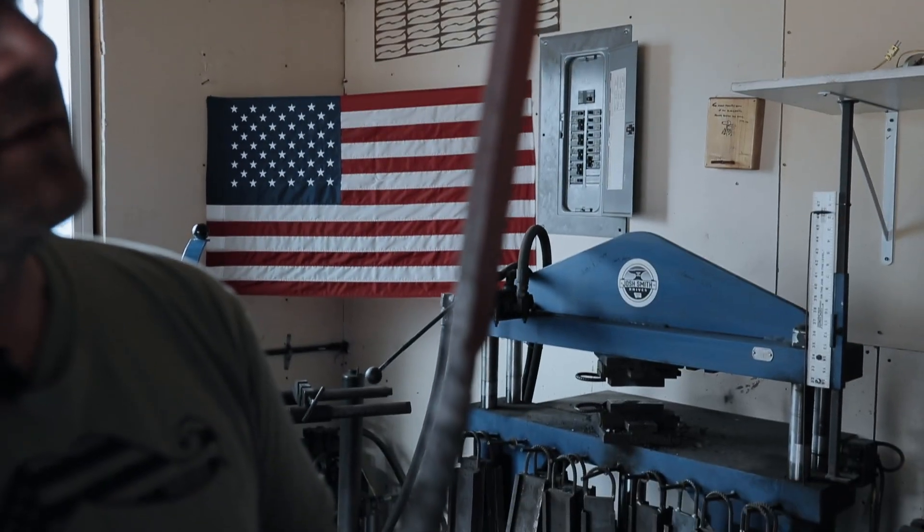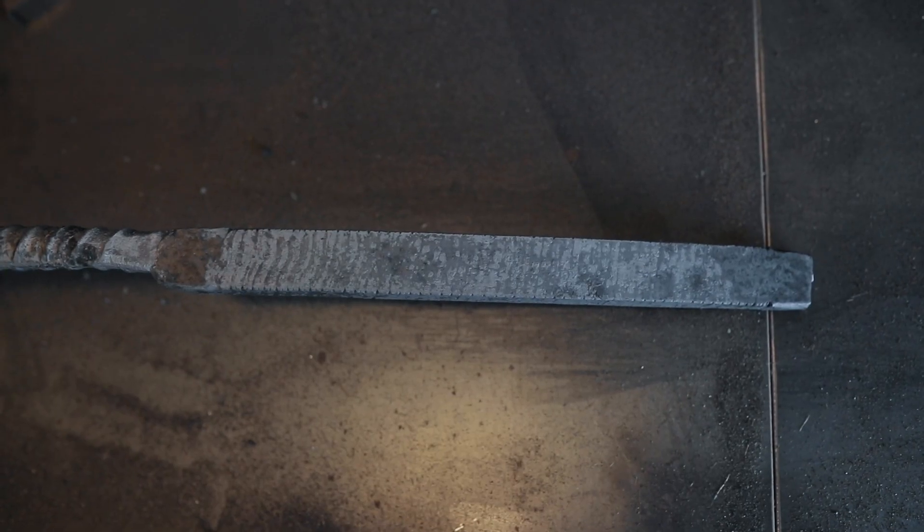We have this bar flat out from twisting. Along the edges you'll see some little surface cracks on the outside corners — they actually look worse than they are and don't go deep at all. I'm about a half inch thick here, which is plenty. What I usually do is stop here, grind the bar, get rid of most of those cracks, and if there's a problem area I dig it out with the grinder. Then I go back to the forge and forge the rest of the way out. These are like cracks in a windshield — better to fix them now. We've got plenty of material and it's a really nice tight twist.